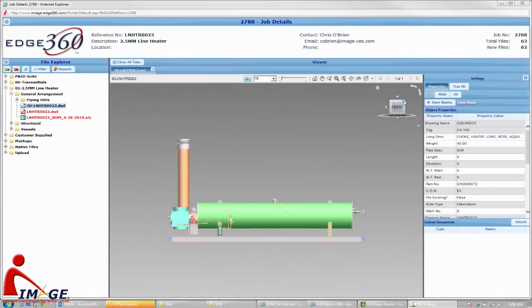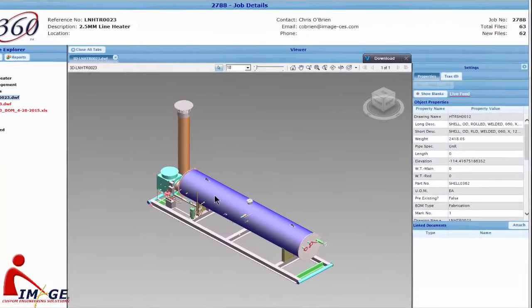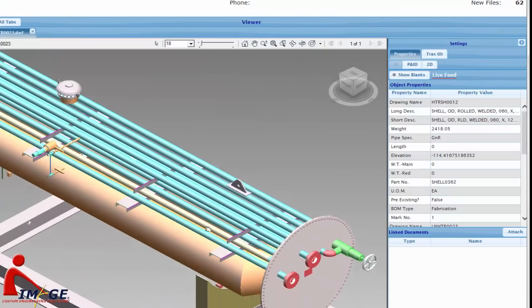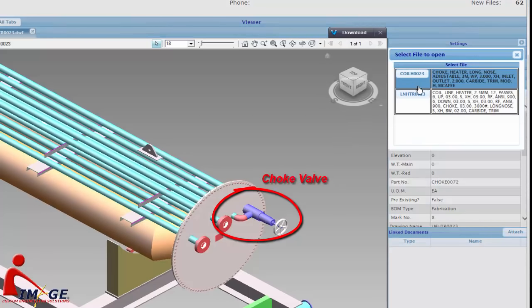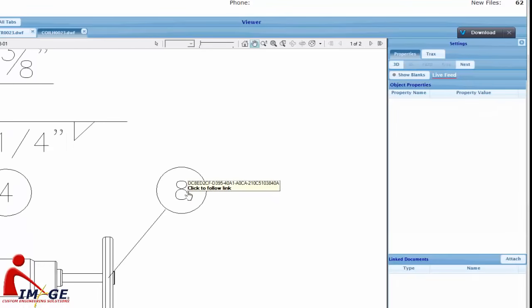It is common for heater coils to have a choke valve built into the heater coil assembly, sometimes found on the inlet, sometimes on the outlet, and in many cases they may be found in the middle where there is an upstream and a downstream section of the coil, each operating at a different pressure. The placement of the chokes is all about keeping the well stream above hydrate formation temperature while keeping it cool enough to provide efficient heat transfer.